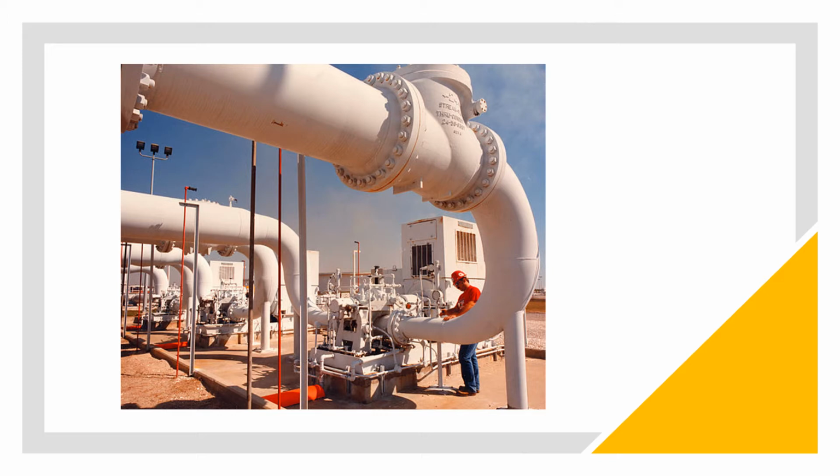Also, you've got to keep in mind that there are other insulation materials that you may use to provide the same thickness or better. Insulation thickness for other insulation materials should be based on calculation and thermal conductivity or insulation class. So if we're reading the specs, we want to find out: is it for personal protection, frost protection, fire protection? This is classified as class 1, 2, or A, B, and we have to take these things into account before insulating the pipe.